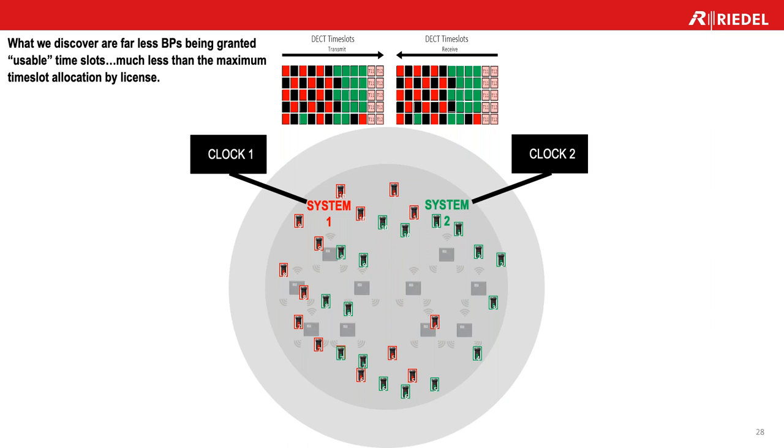And you have to be on separate antenna networks, set up a separate antenna network. Yeah, you would. In the simplest form, you would segregate or VLAN off the antennas, and you would create separate, multiple, unique antenna domains, virtual domains in the Bolero software. So you would sync the belt pack with each of those domains and give the belt pack the permission to go between them automatically. Exactly. You could give or not give permission to roam automatically and connect automatically system to system, or you could also restrict them to manually and deliberately logging onto the next system. And in order to do that, they would of course need a password. Yeah.